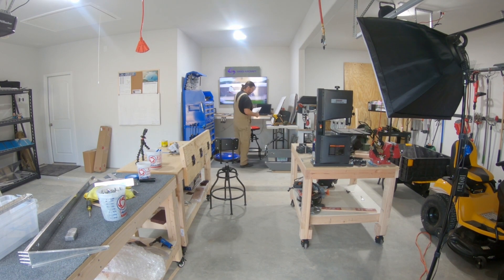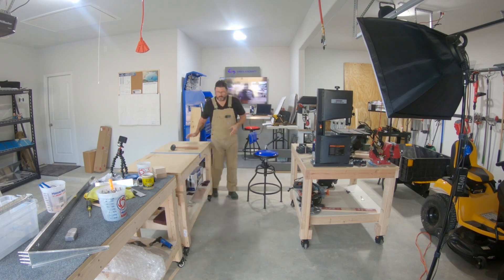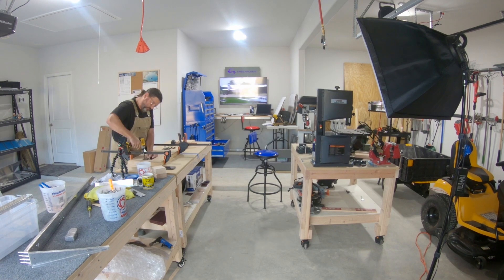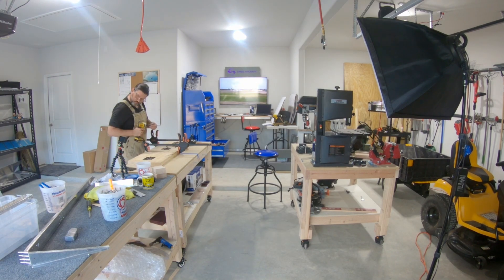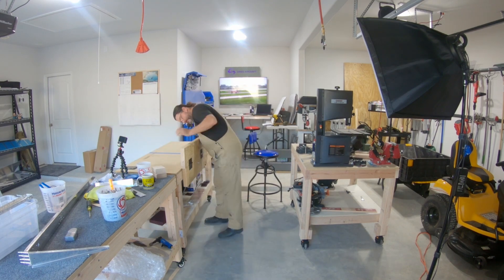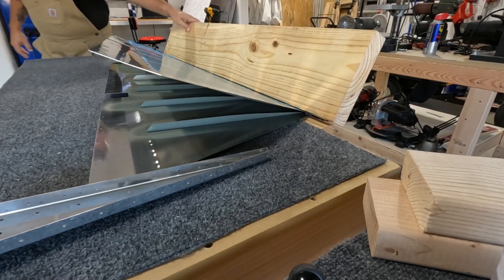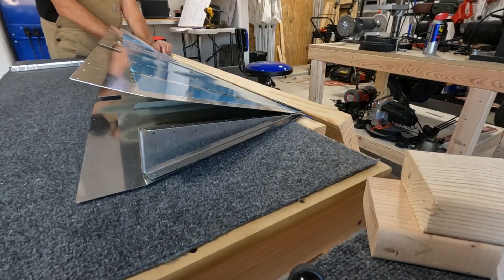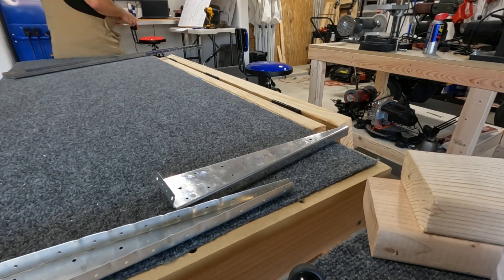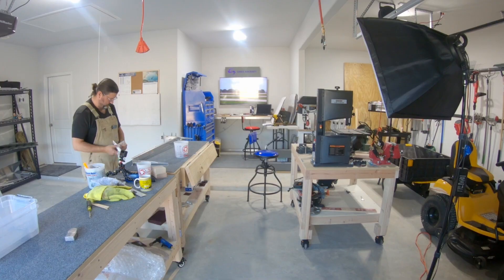This work took place on Sunday, January 8th, 2023. I did record my usual preamble, but it goes on forever and everything I talked about actually happens right here. I reconfigured the bending brake to close up the little gap I had intentionally left between the hinges, worried that I would create a paper-thin crease if I let those pieces sit flush. I just wasn't able to get the amount of bend I needed at the crease.